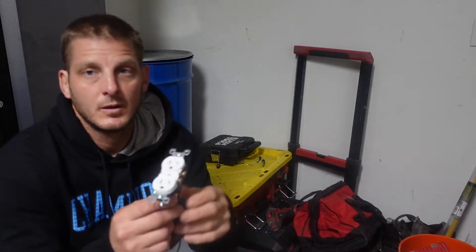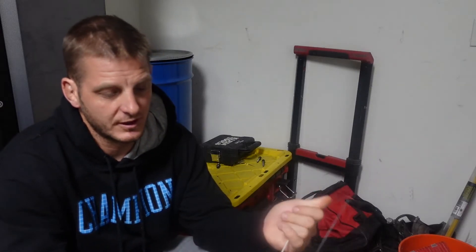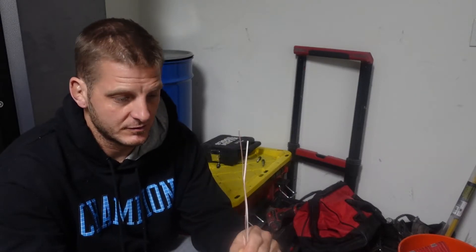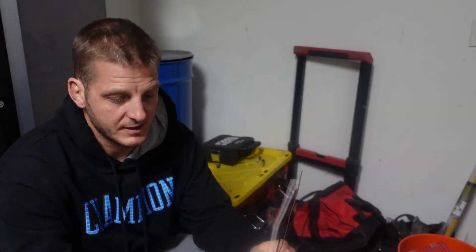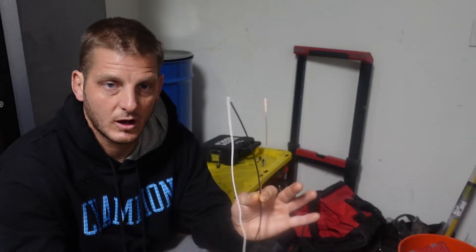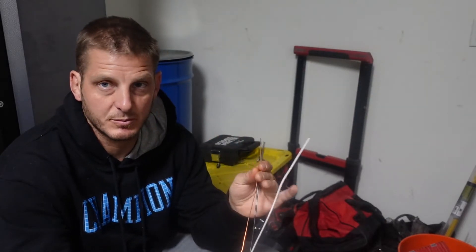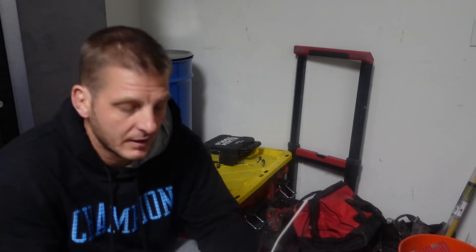This is your correct wiring setup: you have your hot wire, your neutral (grounded wire), and your equipment grounding conductor. These two are connected in the panel — that's what makes this setup safe. If the hot somehow contacts the equipment grounding conductor, it's essentially a near-zero resistance path and it will trip the breaker immediately.